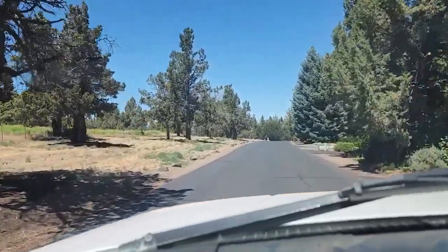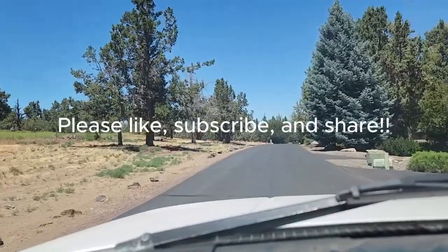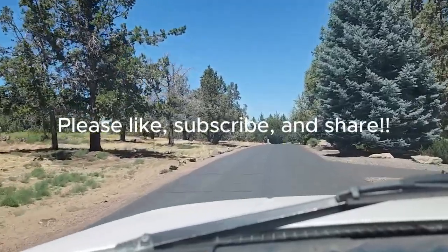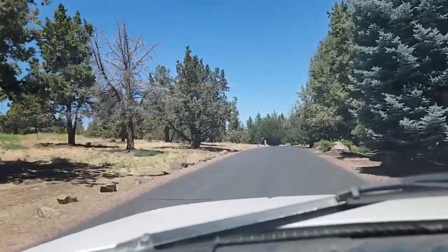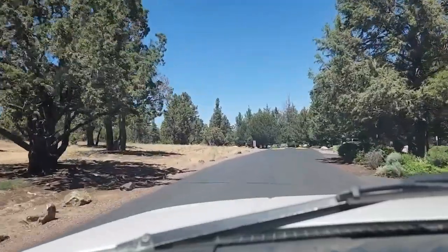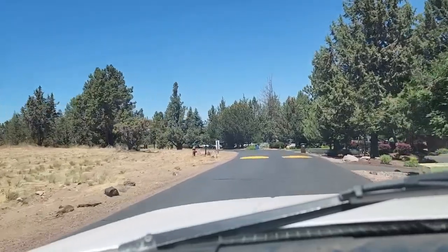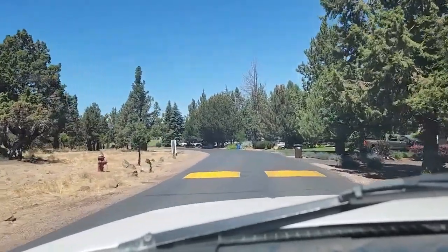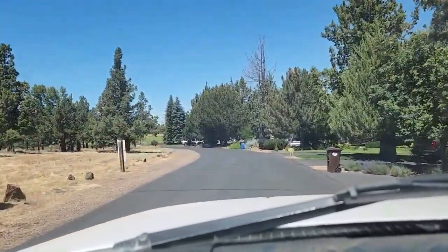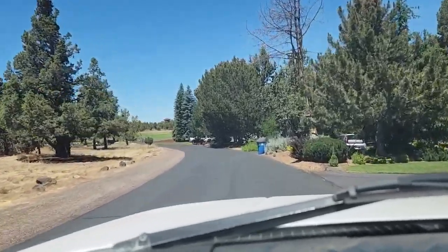Like I said, we tend to get higher splits in this region because the air is so dry. Not like a humid climate where you might get 16 to 18 degrees because it's using a lot of that energy to remove humidity as well. Not to get geeky on you or anything, but we have higher splits here. And when I say split, I mean the difference between the return air temperature and the supply air temperature.